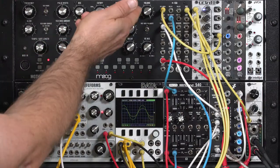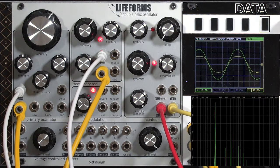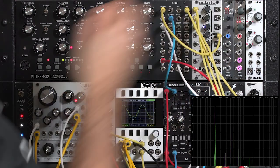As I mentioned before, the sine wave - the green trace out of the primary oscillator - has a slightly different harmonic structure. And the yellow trace, the output of the wave folder at its default setting, also bends the sine wave around a little bit. It actually has even more complex harmonics, and it has even more high harmonics.